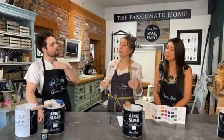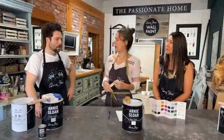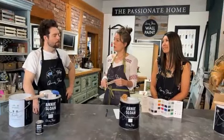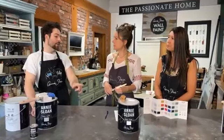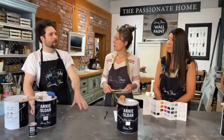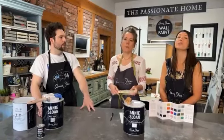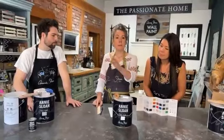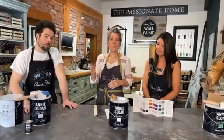Would you suggest someone prime first over the black before going to pink? It depends. If it's a light pink, I might prime before to lock out the darker color. But from what I've seen how this covers, there's a very good chance you could get away with two coats and not have to prime over the black — especially on darker colors. Blacks aren't actually that hard to cover. The hardest ones to cover are reds and yellows. Doing white over pretty much anything is going to be a bit of an issue — even white over white sometimes.